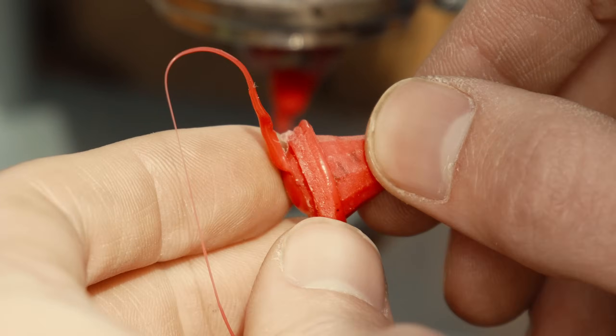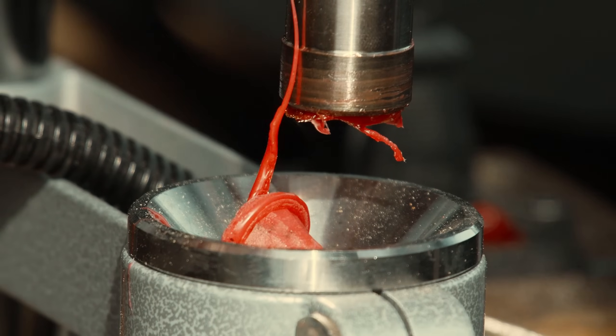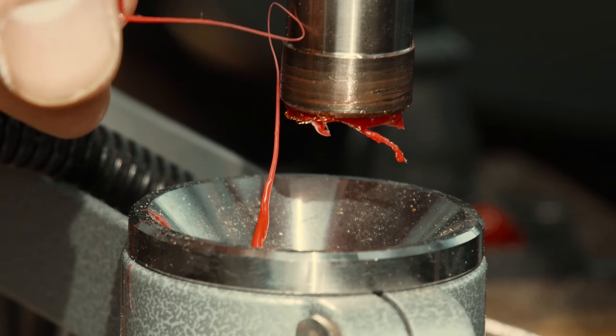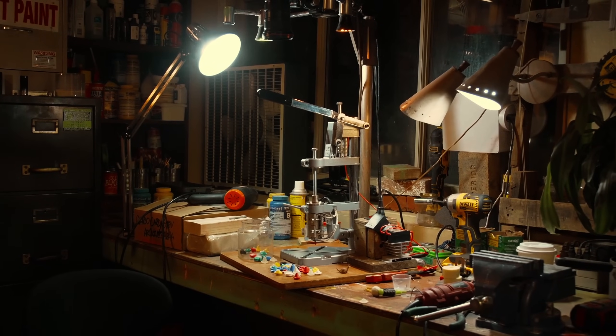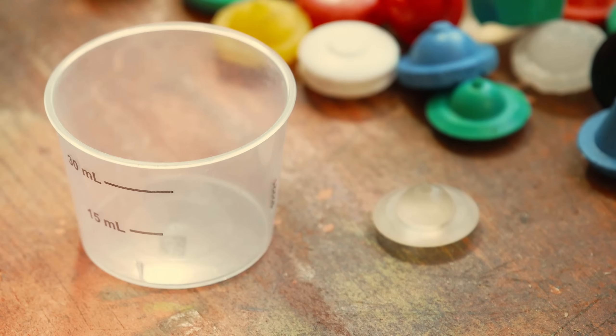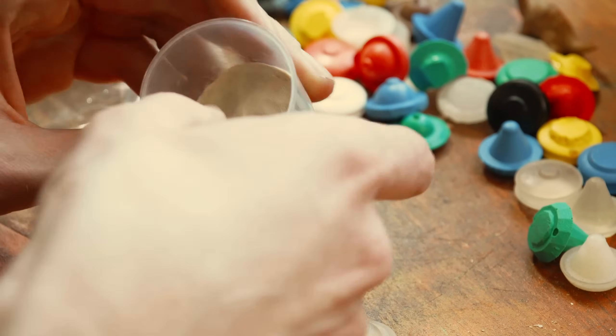Before I go and pay for custom aluminum milled molds, I want to take a couple days to just experiment with dumb stuff and try out materials I already have laying around. The silicone mold had promise in that the material itself didn't melt, but a lot of pressure is required to get all the corners filled and all the air bubbles out, and that's just not something that's ever going to work with a flexible material. So since the flexibility is the main issue and temperature didn't really come into play, I'm going to try some rigid resin next.